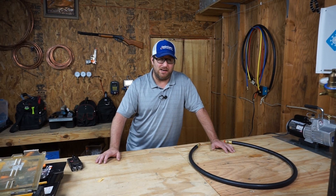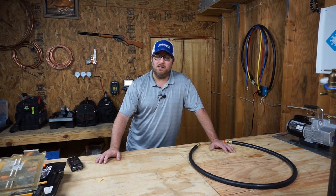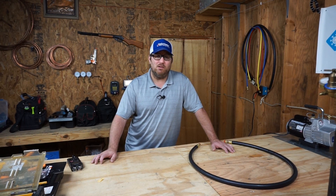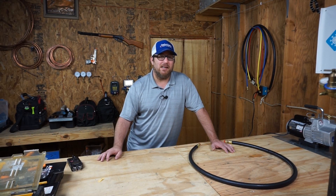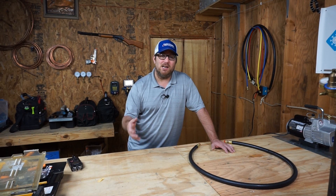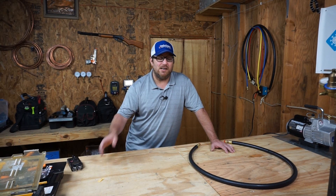But what happens when you put it on an actual load like a cylinder or a system? Also, one of the other questions I wanted to answer, unrelated to the True Blue versus Appion comparison, is: can you pull a 500 micron vacuum on something that leaks with a small refrigerant leak? I have a whole bunch of leaking refrigerant coils that I've removed over the years sitting outside. We're going to test one of those out to see how good a vacuum we can pull and what kind of decay we have on that coil, so we can compare it to a tight system. Because if you're like me, you've had situations where you're thinking there might be a leak in the system but you don't know for sure — is this decay going too fast? You have the Measure Quick app, you have the BlueVac app that will tell you if your decay passes. But let's compare a leaking coil to a tight system and see what the difference looks like. True Blue is ahead — stay tuned.